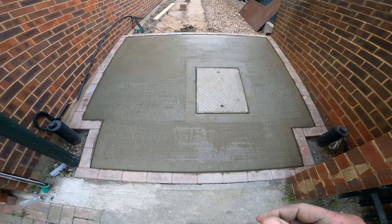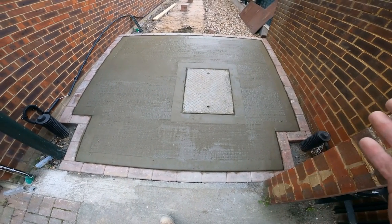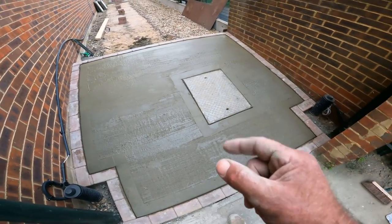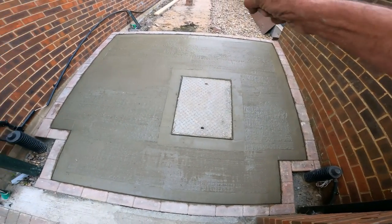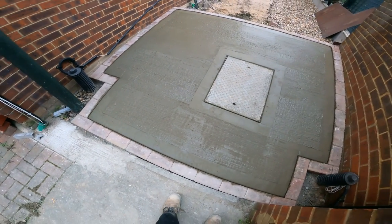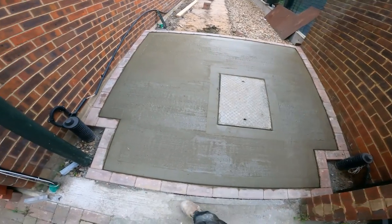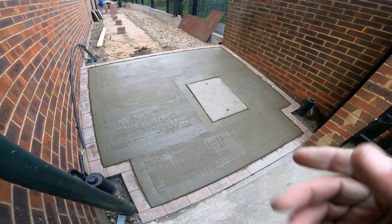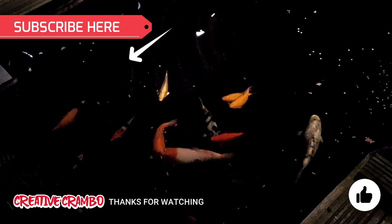Concrete ramp all finished now. I'll give this a tamp finish as well, just for a bit of grip. Eight foot by eight foot — this was all formed using 80mm thick block paviers. I also raised up the manhole there — that's looking really nice. I also edged it all out using a Marshalltown edging trowel to give it a proper nice finish. Overall, well pleased with the job. Like I said, don't make your concrete too wet — it's quite a big ramp — just get your mix perfect. Well pleased with that. Thanks for watching, like and subscribe, turn on notifications and I'll see you in the next one.